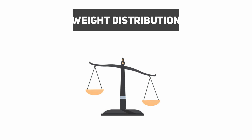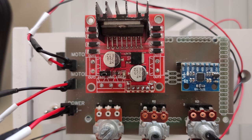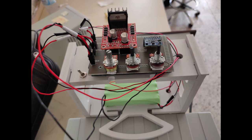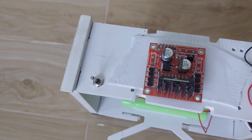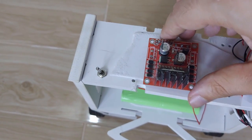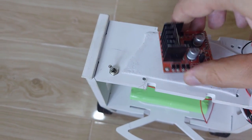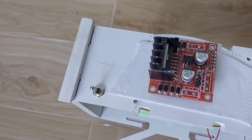Number two on our list is weight distribution. When mounting your components on the robot, make sure to pay particular attention to the weight distribution between the left and right sides. To create weight balance, aim to place your components at the exact center of the chassis. But even then, consider that the components themselves might not be balanced. For example, if you're mounting a motor driver and don't account for the additional weight that heavier components like the heat sink add to one side, you might end up with a robot that tends to lean. A simple change in the orientation of the board can restore weight balance — you can clearly see that the heat sink is now centered on the chassis.